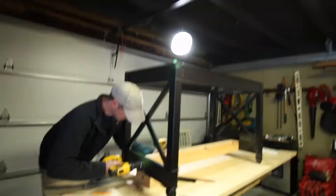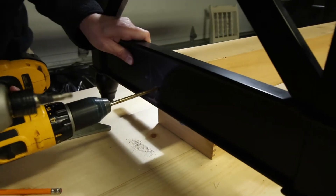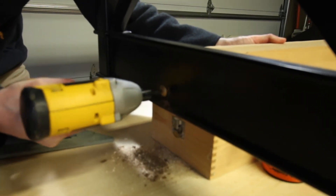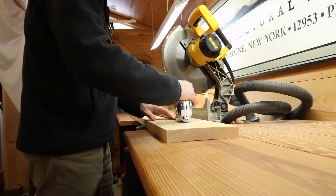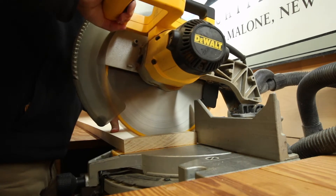My dad basically reinforced the base to make sure it was sturdy. He added a crossbar at the bottom, because typically a desk wouldn't have that middle piece, but it works great for a table. It actually adds to the table so much — it ties in the top board at the bottom, and we stained them the same color and it looks really nice. We started with eight-foot boards but cut them down to seven feet to fit the space better. My dad cut eleven inches off one side and one inch off the other for a fresh cut on both sides, and we did this with all four boards.